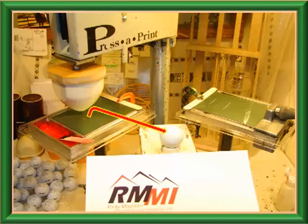Eyeball the red plate under the image, under the pad, and then set the golf ball holding fixture under the pad location. Then do a test print. If the red image lands where it belongs on the product, that side is all set up. Tighten the set screws. Now, do the same on the black side,